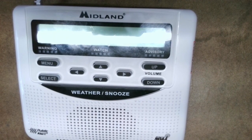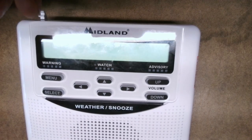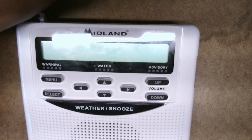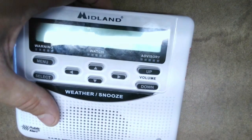You look up on NOAA's website what your frequency is in your area and program this weather alert radio to that frequency. You need to be able to receive it for this to work. When you get your weather alert radio, plug it in with the built-in antenna and see how well you receive it. If it sounds somewhat decent, you don't need an external antenna.